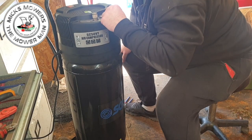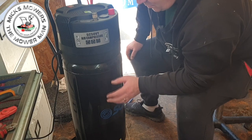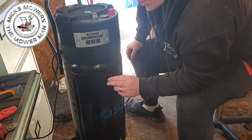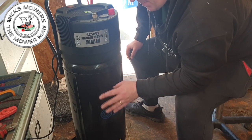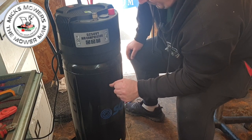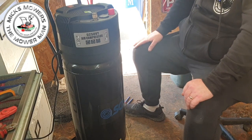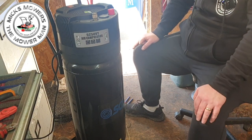So make sure that it's turned off, and then just loosen the vent - the little tiny valve at the very bottom - just a little tiny bit first. Get all the air out the best you can, because it's still reading about half a bar. And then, once it's completely finished, undo it a bit more, but just take your time with it. Don't rush it, because there may be some air still in there, and you don't want to end up with mucky, horrible, rusty brown water all over your face. As you can see, there's no water coming out of mine, because I do mine regularly. So once all the air's been drained out, I'll come back to you in two seconds.